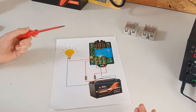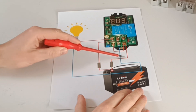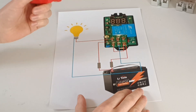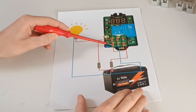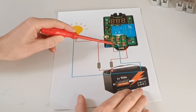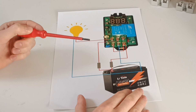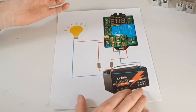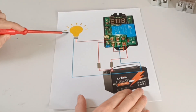Here's how to connect it. Connect the battery positive to the relay's positive input terminal — you should use an inline fuse for safety. Then add a jumper wire to the voltage plus. Connect the battery negative to the grounding terminal. Then connect your dump load between the relay normally open contacts. I recommend taking power from your battery with another fuse, based on the current of the load.